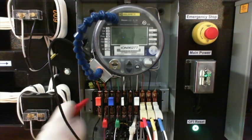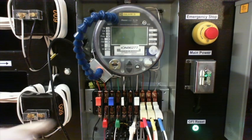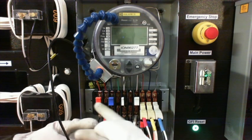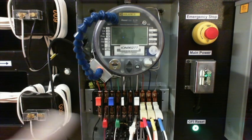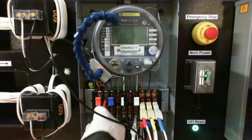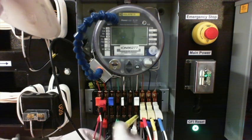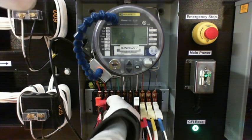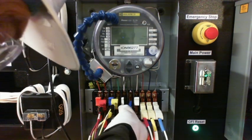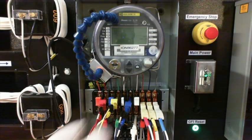So to get a better grip, let's talk about this for a second. You can get up on the top tabs up there at the top, but if you think about it, I'm grabbing onto this thing, and if I get any pull at all because of my cables, I tend to make just a couple of contact points on that top tab. So instead what I'm going to do is grab right here on the jaw. So I'm going to come in here and go red, I'm going to go yellow, and I'm going to go blue. So I'll make my connections there rather than at the top.